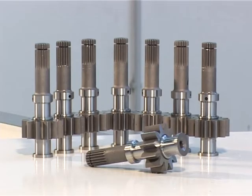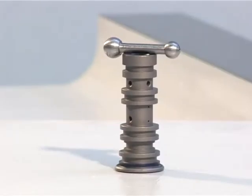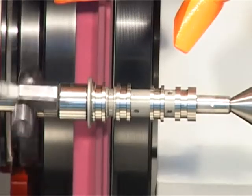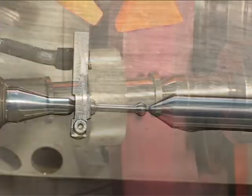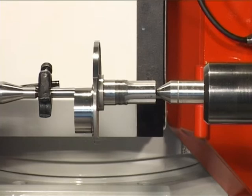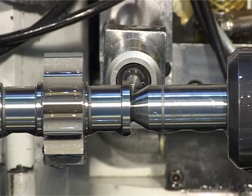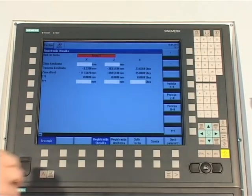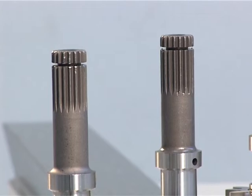Due to its flexibility, the grinder has a wide range of external grinding modes for different work parts: OD grinding, taper, face, slot and profile plunge cut, external thread grinding, eccentric grinding, and grinding of complex profiles. Manual work part loading between centers is used. A touch probe determines the exact axial position of the work part for following processing. The grinder equipped in this way provides reaching of all requested parameters, high geometrical accuracy, and surface roughness.